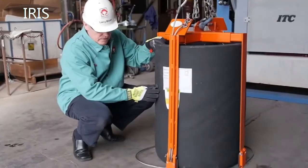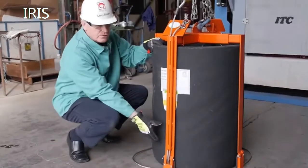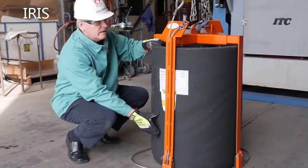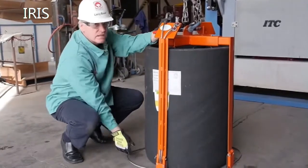What we're going to illustrate — and you'll see as we lift the crucible — is the lifter has some unique hinges here that will contour to the bottom of the crucible. And as we attach these cables to the lifting point, you'll see how it tightens this cable up.